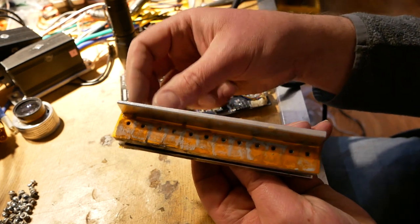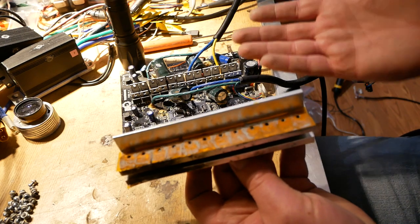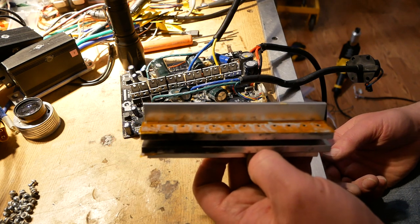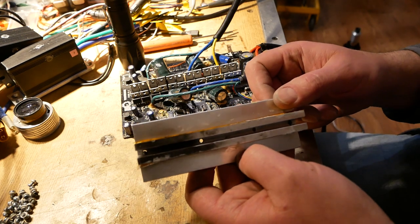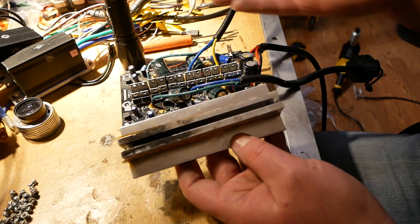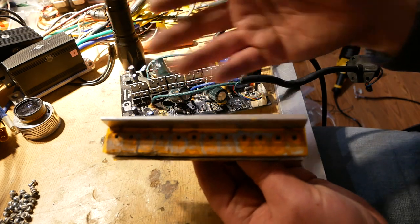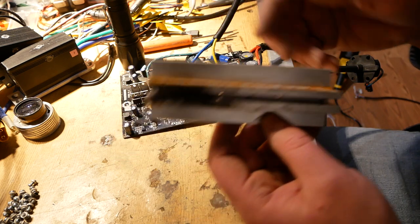The controllers have no temperature sensors in them, so they wouldn't know if they had hot MOSFETs. They certainly wouldn't know to shut the power down to something less than 11.5 kilowatts because the MOSFETs were too hot. Bad design. Heat differential differences are never good in a motor controller design, and no temp sensors is again a bad idea.